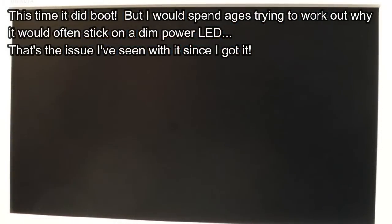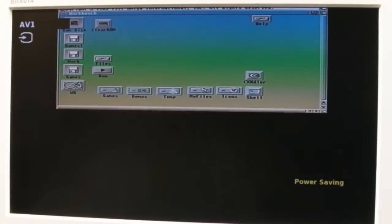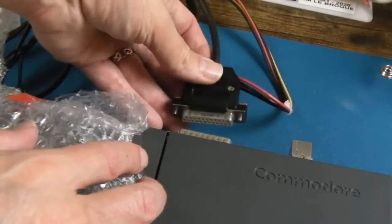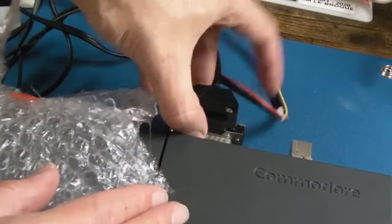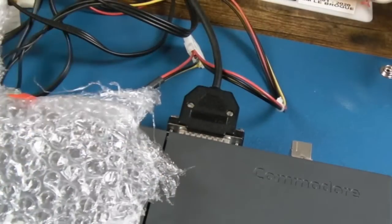This TV's doing that thing again where it's half height, and obviously it's the composite that's confusing it here. And in fact, I'm not sure why I'm messing around with the composite here, because I'll switch it off here, the back of the unit there now has RGB via the backplane thing. So we'll just connect the RGB cable up. Still need the left and right audio connector. Yeah, that's on SCART now.